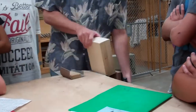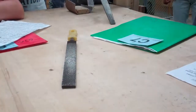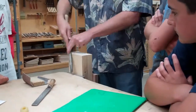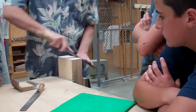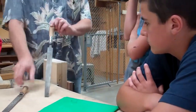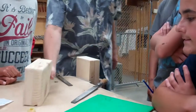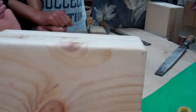That's the least you want to do. If it's uneven, don't round the edges over yet — you want to get files. These files take a little bit off. We want to round it before we sand it; if you just sand it, it's going to ruin your sandpaper. Round most of it, but do not round the bottom — leave that flat. Go around that corner, that corner, that corner, and sand over it. You can use the smooth file or the small rasp. Each one of those will take off a little bit and all the edges will be rounded.